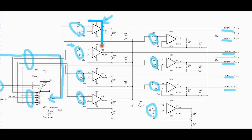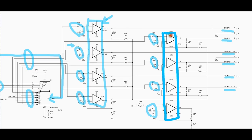Since channel two is working, it means most of these circuits are functioning. The only unknown is potentially one of the op-amps. However, U25 contains all of these op-amps in one monolithic package, making it unlikely that only one would fail while the others work. These are quad op-amps in surface-mount packages. We can measure the voltages at connectors P5 and P4 directly on the PCB and change the voltage setting to confirm these circuits are all working.